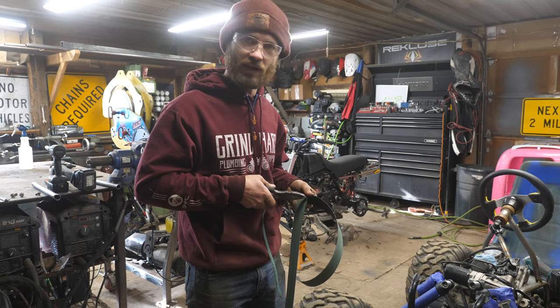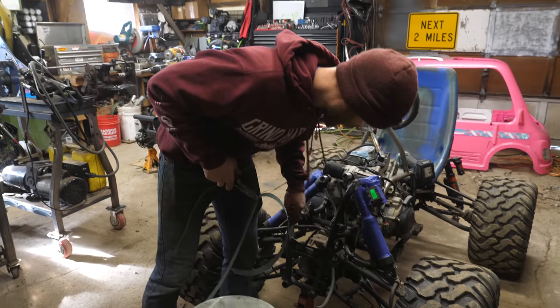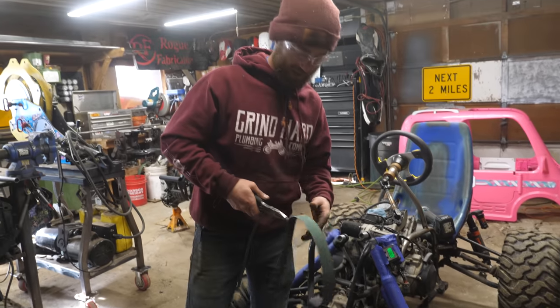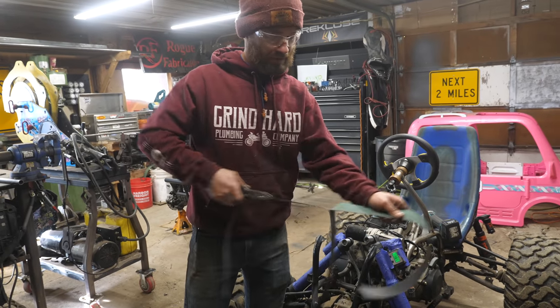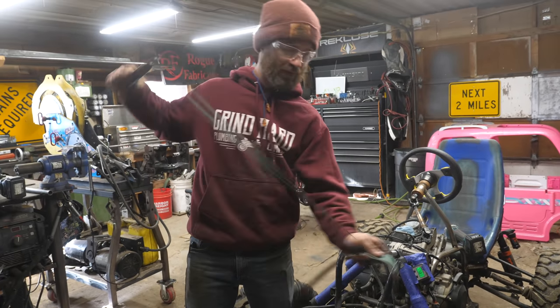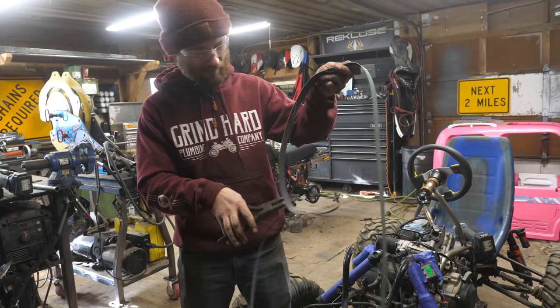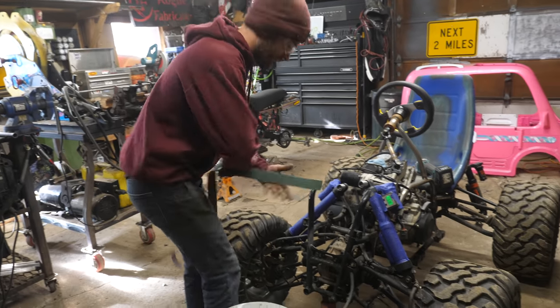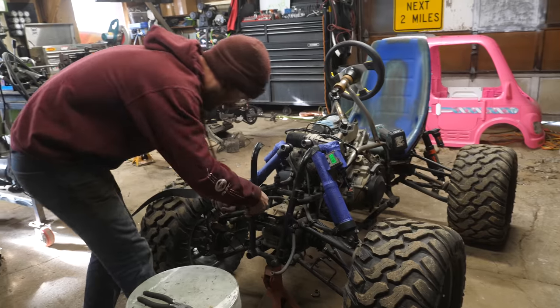Experiment here where I'm actually trying to do things right the first time. I'm about to weld a tube onto here, and so I'm gonna actually sand off all of the paint before I weld the tube on. So I've got a used up belt from the belt grinder here that I'm making a little thinner so it'll fit into the spot.